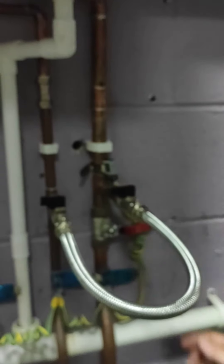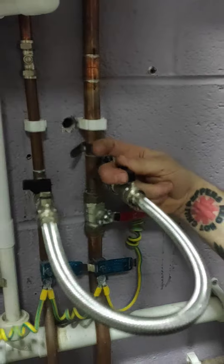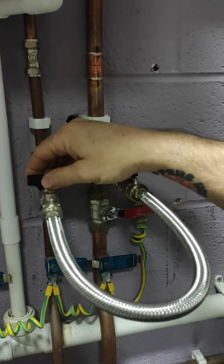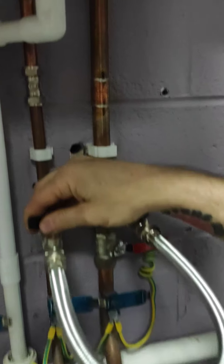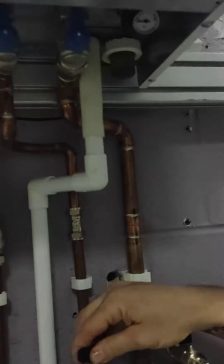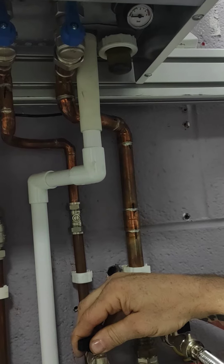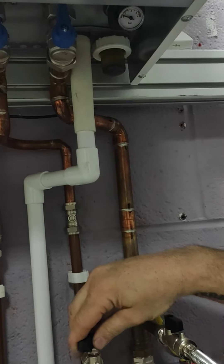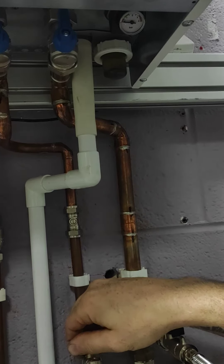What we're going to do is open one of the taps slowly first, then the other tap we open slowly until the pressure reaches just above one bar. If you do it slowly, you know that you're going to be in full control of how much pressure you put in the boiler. If you do it too much, you'll go too fast and won't be able to control it.